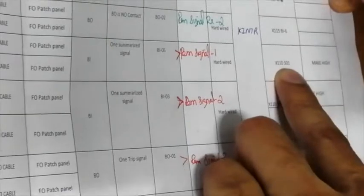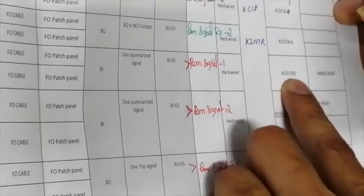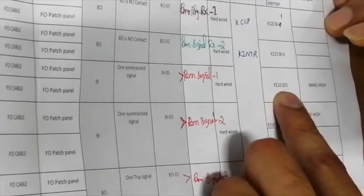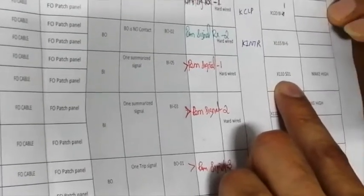So the ABB relay is getting the status of the breaker, the 11 kV breaker, the 11 kV earth switch, and if there is a fault or anything on the 11 kV panel. So all this information is gathered by the ABB relay installed in the incomer panel.